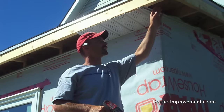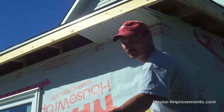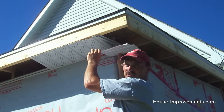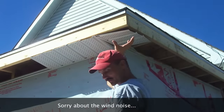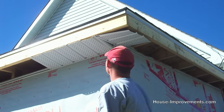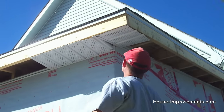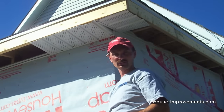While I'm right here I can also start the piece going up on the slope on this gable end. Same idea — it just fits right in the J-channel. I'll keep continuing on up the roof, and then come back to show you how to install the fascia.